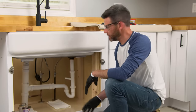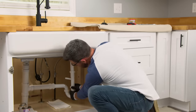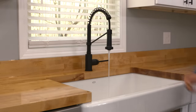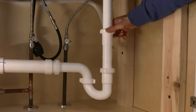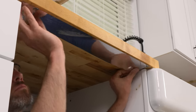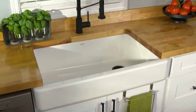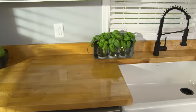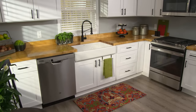At the sink hole side, slip nuts make for an easy hookup — just make sure all your washers are in place and hand tighten. Once everything is installed, run some water to check for leaks. You might need to reset the washers and nuts if it's leaking. Finish up by applying a moisture barrier tape above the dishwasher. This renovation is now complete — you can see how this butcher block countertop and farmhouse sink give this kitchen a lot more personality. These are definitely more advanced projects, but with a little effort and the right planning, you can do it right.